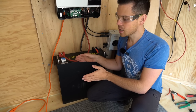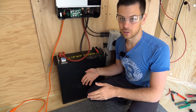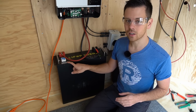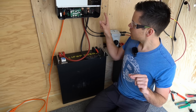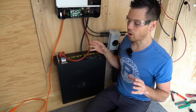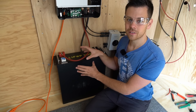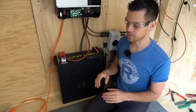If you have more than two batteries I recommend using a T-class fuse. The amount of current that parallel batteries can produce can be quite substantial because the internal resistance of this chemistry is very low — you can have a huge rush of current, potentially tens of thousands of amps. If you have multiple batteries in parallel, it's a very good idea to use a bus bar system on your server rack. Put a T-class fuse on the supply conductors as close to the bus bars as possible. Always use T-class fuses for lithium iron phosphate in large systems — the small breakers work fine for a single individual pack, but for large battery banks T-class fuses are essential.